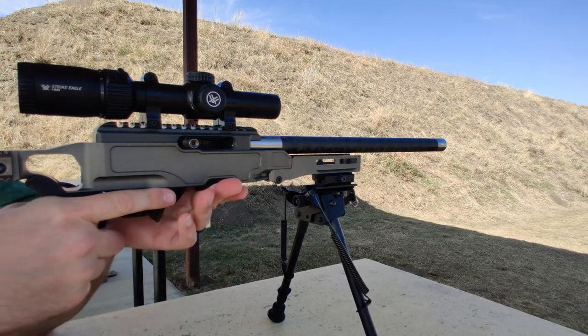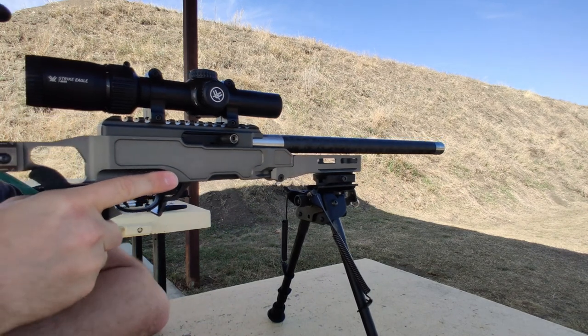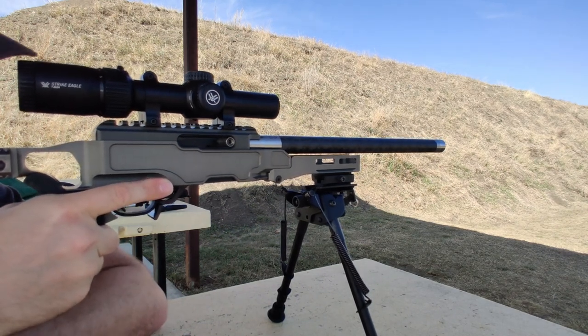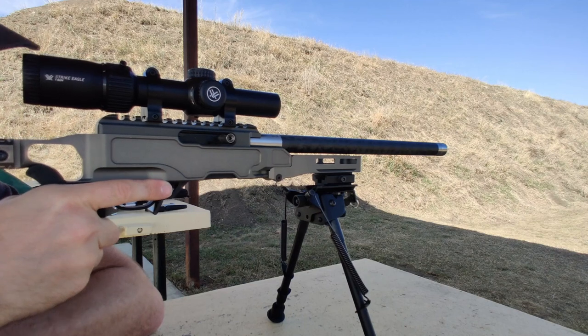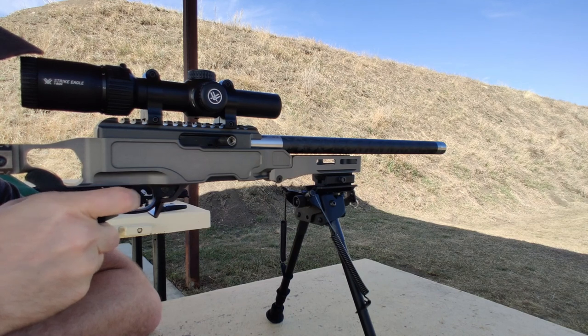I originally ran this receiver with my 45-year-old stock Ruger bolt from the 70s, and while the bolt has always worked flawlessly in its 45-year-old stock receiver, these two parts did not work well with each other. That short period of time was marked with failures to eject regularly and with less than stellar accuracy.